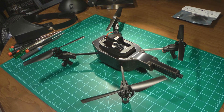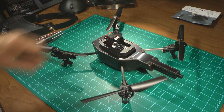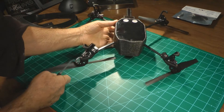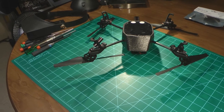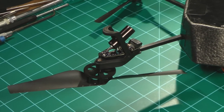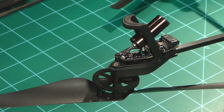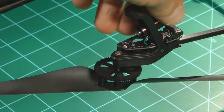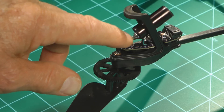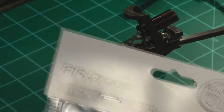Well, it was bound to happen. On the last flight, it hit a tree high up and sustained about a 20-foot fall. It landed on a concrete slab. What happened was the motor became disengaged from the housing. This is all new to me and I've never taken one of these drones apart, so we're going to do some investigative surgery. The propeller goes around but the motor came out, and the pinion gear that goes right there is missing.